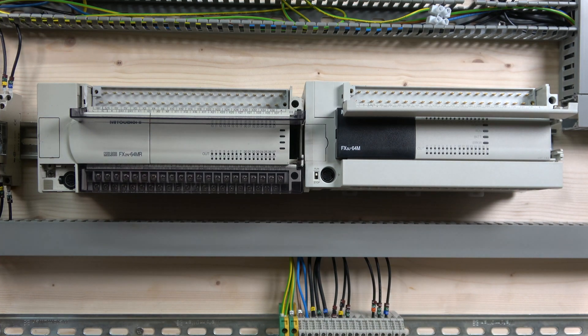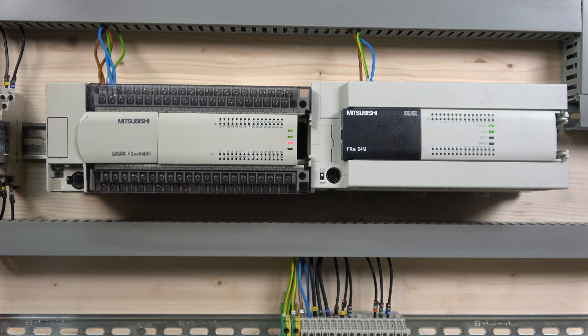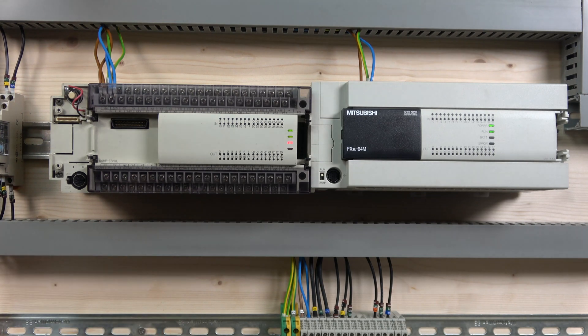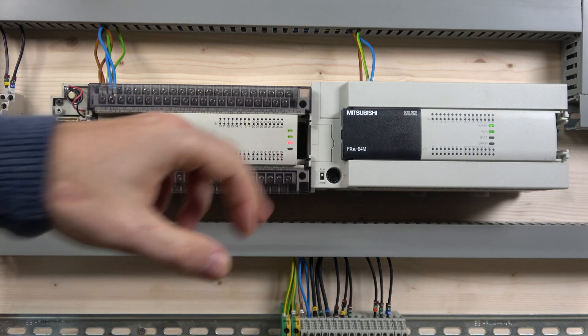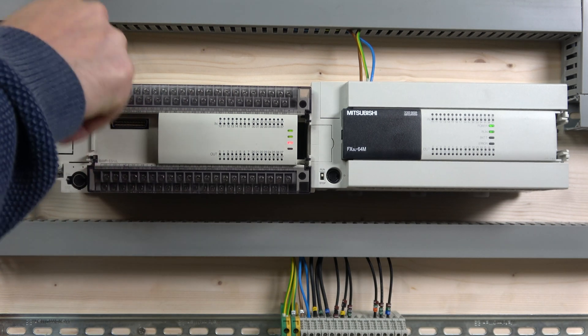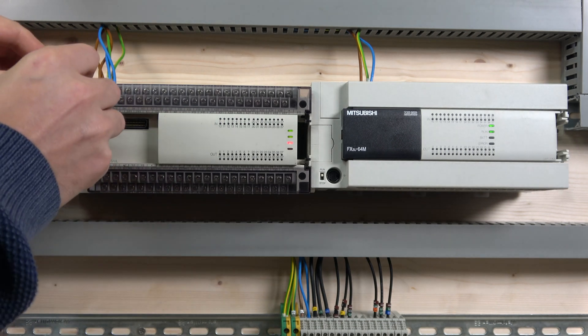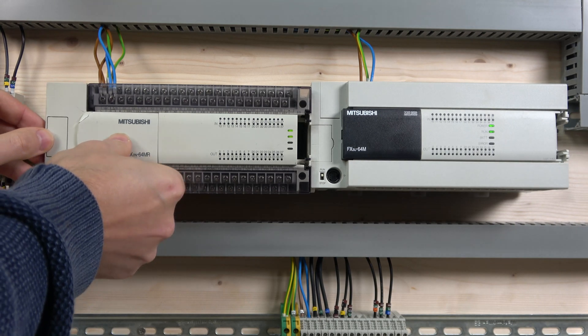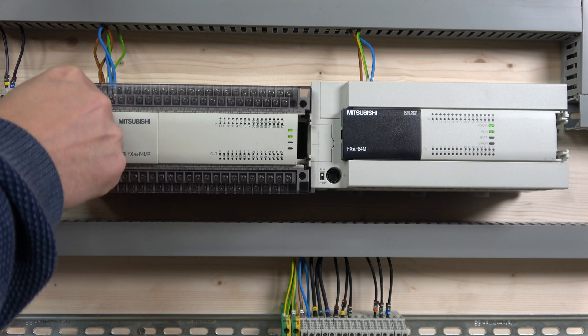All wired in and ready to go. The PLC is flashing red — it was flashing two reds, but I went and cleared the memory because the battery has gone dead and pretty much everything inside the PLC has been lost. You are not able to program or do anything until you clear the memory. If you ever come up with both lights flashing red, your program is gone — first replace the battery, then reload the program. Once you wipe the memory, the PLC returns to its normal state and is able to accept the program again.